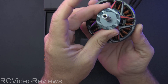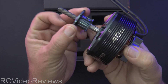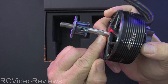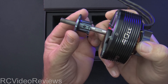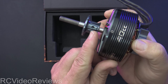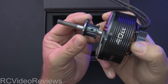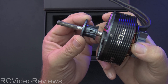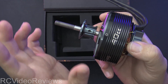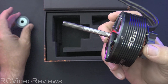This follows the same form factor as the others. One of the really cool features about this motor: there's about a 10-millimeter flat spot, which means you get about 10 millimeters of adjustment. Right in that hole there's a grub screw that allows you to adjust your backstop up to about 10 millimeters. That's really nice to get your backspacing exactly right on your cowl — a very cool feature. I absolutely love that.